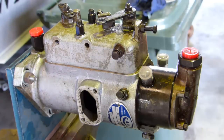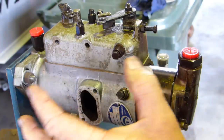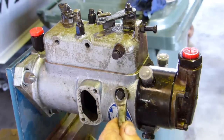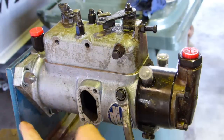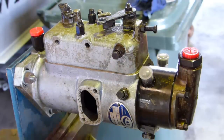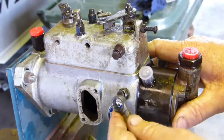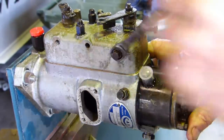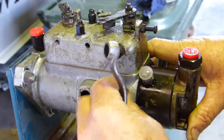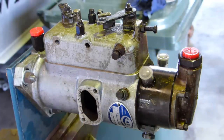If you've been following along on the Massey Ferguson 135 series, I explained about taking this off and checking the timing marks when removing the pump. I've made a little plate to bolt my pump to only because I do a lot of them and do them for customers. You can hold it gently in a vice or whatever you like. First, I start off with just loosening these bleed screws. You'll notice this one's all chewed up - that will be replaced when we get to it.